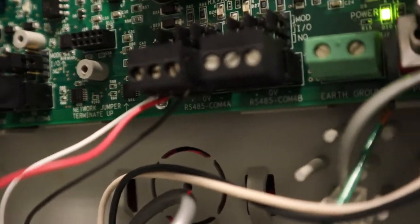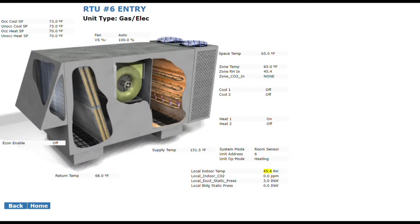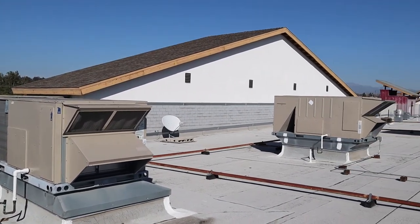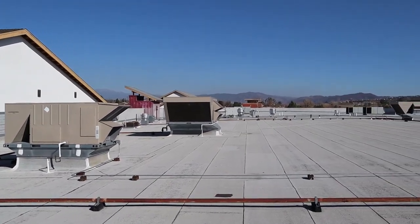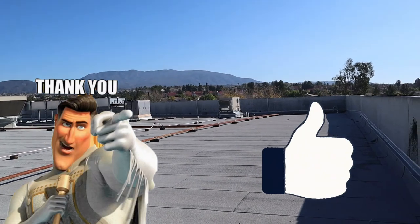This is the store we were on earlier — it's online right now. People can dial into it and make set point changes. Right now it's at 65, still cold. RTU number two — they're both online and reading back. Everything's good. I'm guessing somebody was going through the menu and accidentally adjusted the address. It happens. Thanks for watching — leave a like and you know what to do.